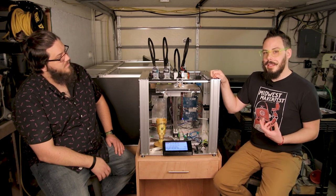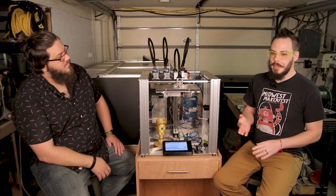I don't use Simplify3D anymore. I used to use it, but I found that I like Prusa Slicer better. Prusa Slicer does have some holdups, though, because of how the post-processing scripts are done. There's a little bit of background knowledge that you need. Because of how RepRap firmware works, the post-processing scripts are absolutely needed. With RepRap firmware, M104 and M109, which are your tool heat up and standby, or wait until fully heated commands, are deprecated. They're no longer used.